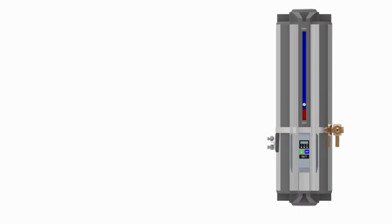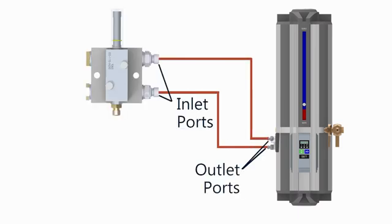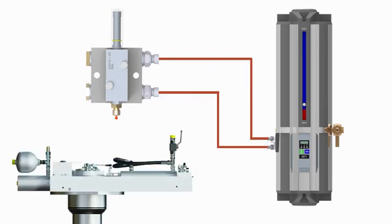The doser is used to limit the volume of grease dispensed in each auto greaser lubrication cycle. Grease is fed from the two outlet connections on the control unit into the two inlet connections on the doser assembly. The controlled volume of grease is fed out from the doser assembly to the consumer, typically a stabilizer hull unit, via a single outlet port on the doser assembly.